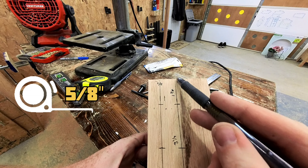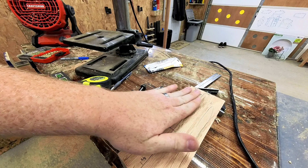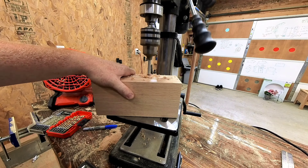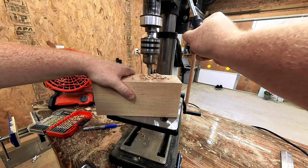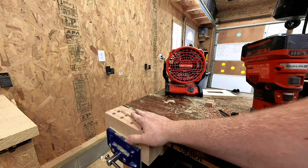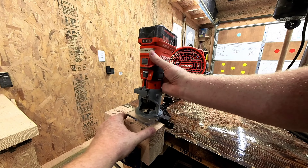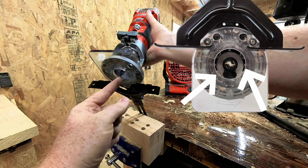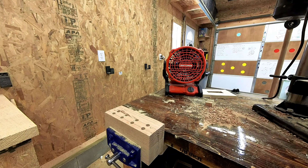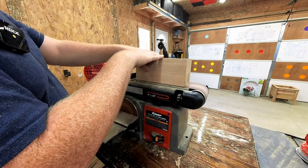Five-eighths in for the first line and then one and three-eighths for the second. This center one will probably be at one and five-eighths — I wanted it to stand out a little, have more room since it's going to be a little wider. Then I began drilling the pinholes using the half-inch Forstner bit. Life is full of ups and downs, and so is using a Forstner bit. Back in the vice, I offset the line to three-quarters of an inch and set up the palm router with a guided fence to cut the horizontal groove, going until the inside corners touch. This is supposed to be a relaxing hobby but every cut and hole had me stressed out.